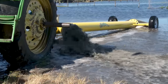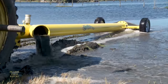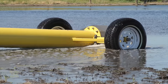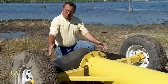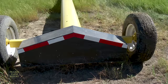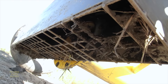The unit is working without the hose, just to show how it keeps pumping water right down to a depth of about 6 inches. This is made possible by the unique water intake device on the back end of the unit. It bolts right onto the back of the pump and gives you 10 linear feet of area for the water to come into the pump from underneath. We've nicknamed it the bottom feeder. It allows us to pump 3,000 gallons a minute in about 6 inches of water.